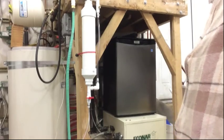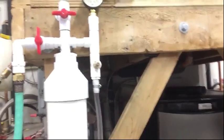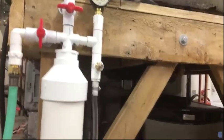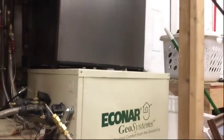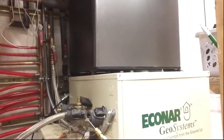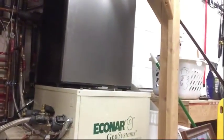So this is a solution I just came up with, and it's working really well. Out of some PVC I've created a bit of an invention here. This whole tank will pressurize the system through the pressure-temperature port. This fitting here goes into the pressure-temperature port — you don't have to break into the system, you don't have to open any pipes. We're just going to inject just enough fluid so that we can pump it up again.